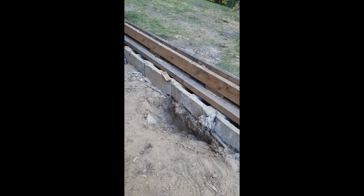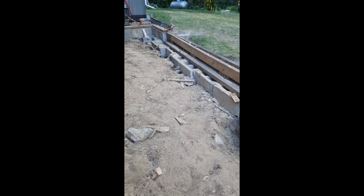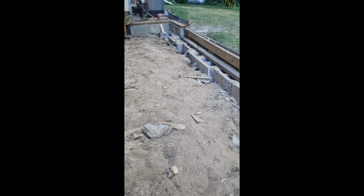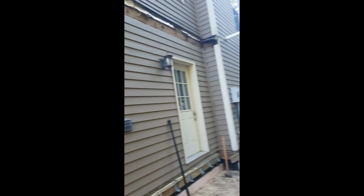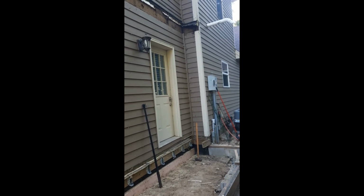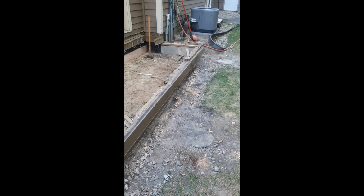Backstory behind this house is back in the late 80s, early 90s, this house actually was moved from a lot across the street over here. I don't know the whole story on why they moved it. So we're thinking the porch was already on the house somewhat, and then they moved the house, and then they tried to put footings underneath the porch after the fact. And then the theory we have is that the footings maybe weren't done correctly, and then the flat porch roof that was up above, we're thinking it was leaning backward towards the house, so it was draining backwards. So the original flat roof was rotten and not that great, so they went back and they added a second layer of roofing above the original layer to give it a little bit of slope.